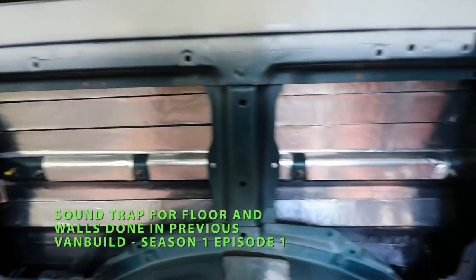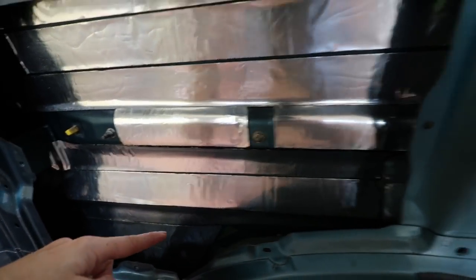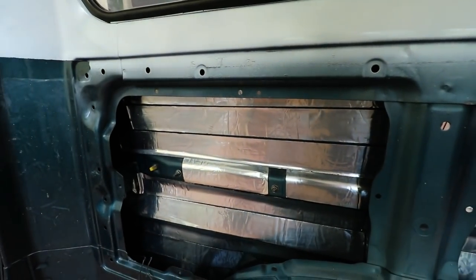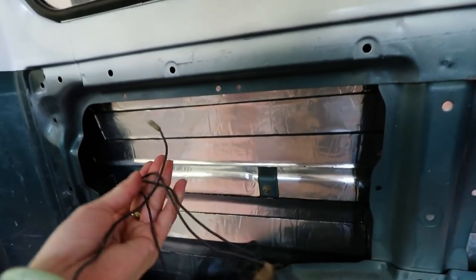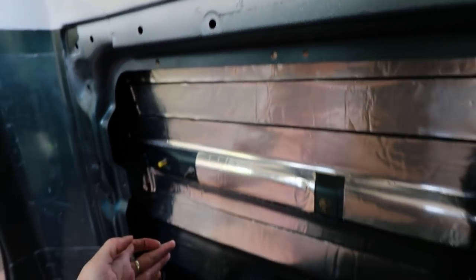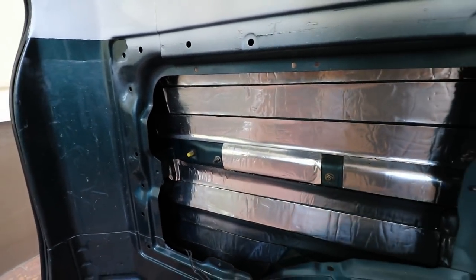So we're going to start by insulating the wall panels and inside the cavities down here and down this side here. What we got to do first is, apart from clean the surface, take these wires, get them out of the way and run them along the top around there, and then do a partition here so that the wool won't block the wires for future.